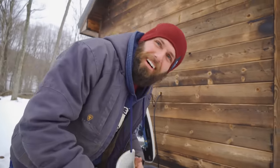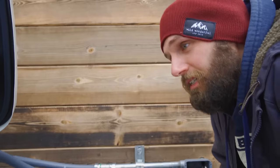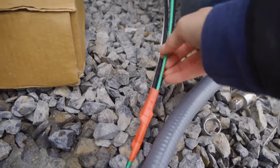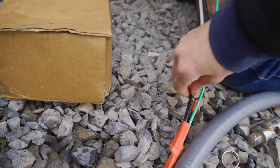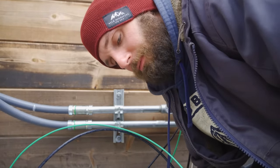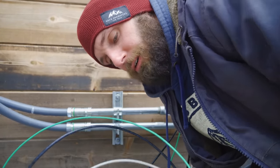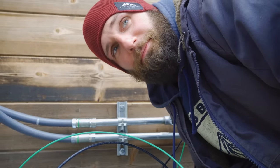Do you need me to show you how to wire up this generator or do you think you can handle it on your own? Go ahead, Erin. This is your hot - yep. This is your ground - yep. This is your neutral - yep. And this is your second start-up wire? I'd call it black - A phase, red - B phase. Both are hot. My ground, my neutral - the start wires aren't pulled yet and they're control wires, not line voltage. I was just making sure you're paying attention.